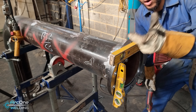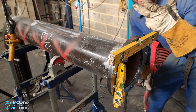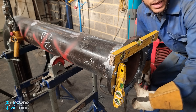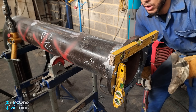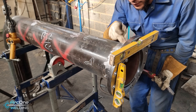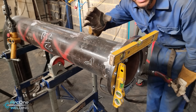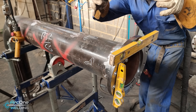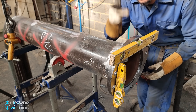I've got the flange basically leveled bolt-hole wise. Three fingers is all you need — two at the bottom to grab the flange and your thumb touches on the pipe — then you pull it out and guide it while the tack is still manoeuvrable before it gets too solid. You try to move it as much as you can. I tack directly in the middle, perfectly in the middle of these two bolt holes. If you stray side to side, by the time you flip it 90 degrees to level the other orientation, the flanges twist ever so slightly and it changes the bolt hole pattern — so make sure your two tacks are exactly parallel.